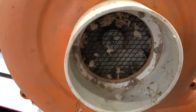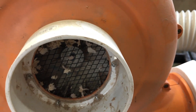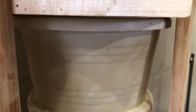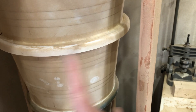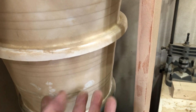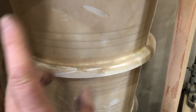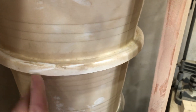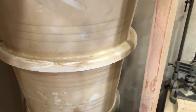I'm going to keep that screen in place. I think part of the trouble is the pipe extending down into the cone — it comes down too far and is a little too narrow. As things swirl around in the cyclone, they slow down, and the strong suction is drawing particles off the cyclone wall and back up. One option is to cut the pipe off much higher so there's more velocity and centrifugal force keeps particles against the wall, far enough from the inlet that they won't be drawn in.